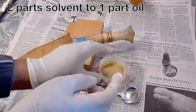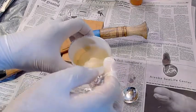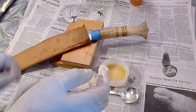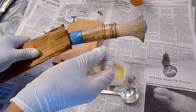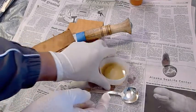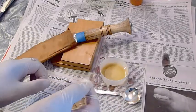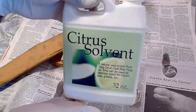The oil mixture is a two to one mixture. Two to one dries faster, and I'd rather have my wood dry and put on more coats to be safe. More coats add luster and shine to your wood, so it's a good idea to put on as many coats as the wood will absorb. This is two parts citrus solvent to one part tung oil. You can also use mineral spirits, but mineral spirits is toxic, so you shouldn't use it for making bowls, wooden spoons. So I use the natural citrus solvent.